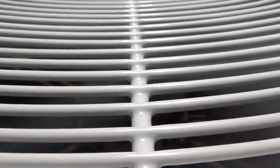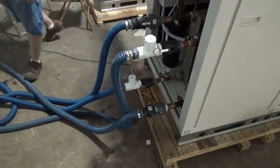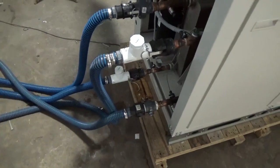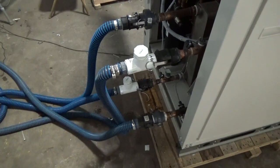We had them put it in just cooling mode, so you can see the condenser fan turning on. What it's doing now is evacuating heat like a traditional heat pump from the refrigeration lines. But if it was in simultaneous mode, all that heat would be going into hot water. As the compressor changes modes it's beautiful — it does not shut off, it just changes speeds and never actually turns the compressor on and off, which is wonderful from a loading standpoint on an inverter. You're not hammering the inverter each time you switch modes.